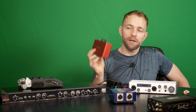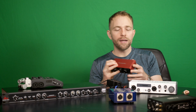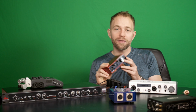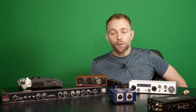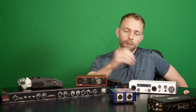With the Focusrite Scarlett Solo 3rd Gen, it didn't make as much sense to buy a Cloudlifter for this thing. We saw that it actually increased noise by about 1 decibel when we connected it. And with the software driver gain functionality that allows you to increase the gain past the 56 decibels that it does at the hardware level to whatever you want, you don't need a Cloudlifter to add that extra recording gain. It does it through software.